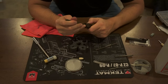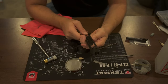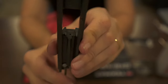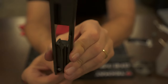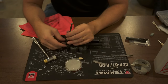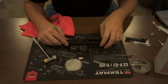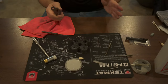Now we're going to check function. The firing pin should not stick out of the breech face while I compress it with the punch. I'm going to poke the back of the firing pin and the firing pin does not protrude — that is a good sign. Now we're going to push in the firing pin block and push the firing pin forward, and we should get full extension on the firing pin. And as you can see, we do.